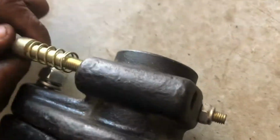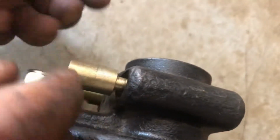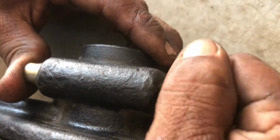Push pin. Push the pin and slide the yoke onto the PTO shaft so that the pin engages the groove on the PTO. Make sure that the pin returns to its initial position after attachment to the shaft.